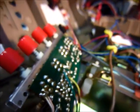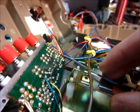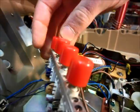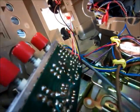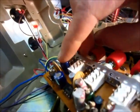I actually don't think the potentiometer was the main problem. The main problem was the two capacitors that were in series with the speaker. Usually there are capacitors in series with a speaker so that the speaker doesn't draw too much current — the capacitor charges up and then the speaker can't draw any current. There were two 220 microfarad capacitors, and these two were bad. I popped them out — I traced the circuit back because the signal was very weak. Using the oscilloscope, I noticed that on one side of the capacitor the signal was really weak, and on the other side going to the amplifier it was very strong. So I figured that capacitor was dead. I popped it out and tested it — it was only a few nanofarads. Yep, that was the problem.